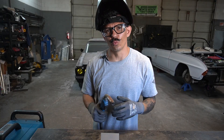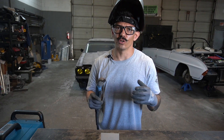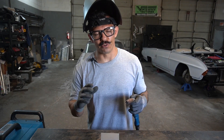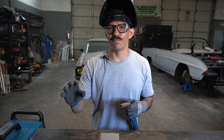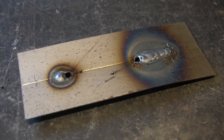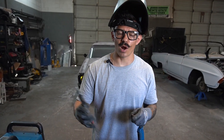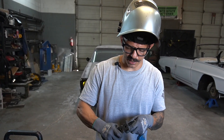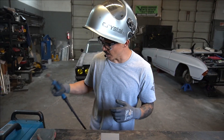One way to tell you've got a good weld is penetration — you want penetration on the back side of the weld no matter what you're doing. If your weld is too cold, you won't have penetration and the bead will be really tall; if too hot, it'll be really flat or you'll start burning holes. I also always keep wire cutters nearby and cut the electrode down to an eighth to a quarter of an inch before striking an arc — that ensures a nice clean start.